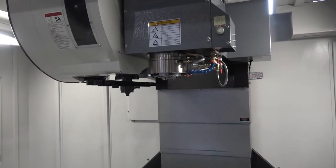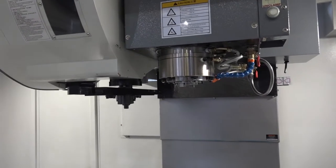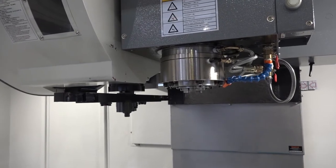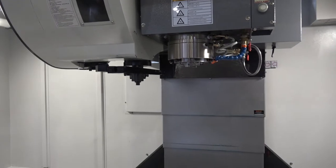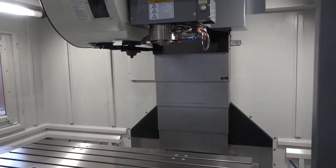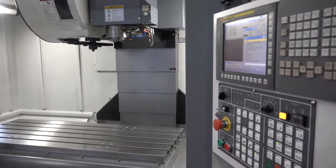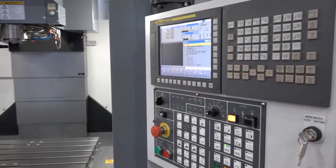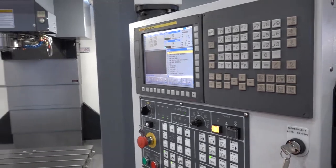What Dugard do push a lot on this is the tool changer. A lot of machining centres have kind of 22, 24, or 30-station tool changers. This range of XP machines actually comes with 36 tools — certainly the 1350 model does come with 36. They're BT40 and it is a 12,000 rpm spindle. Some of the niceties that come with this machine include the option for either a FANUC control with the Manual Guide software, or you can go for the Siemens control which also has the ShopMill software.